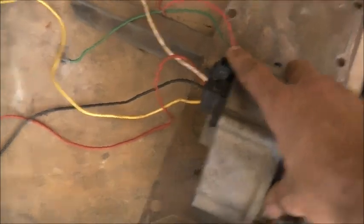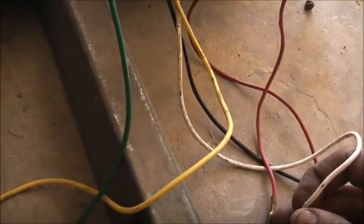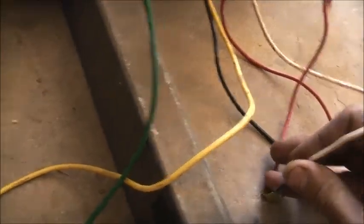Excite the inner field — it obviously generates AC. I've taken the diode pack out and the regulator out. The right tap gives me 72 volts between there and there; this one gives 42 volts between there and there. Another two are the excited ones. I'm going to see if this will actually self-excite this time, because it does generate between 0.3 and 0.6 volts depending on the RPM when there's no excitation. There was a little bit of residual magnetism in that inner rotor there, so we'll connect this up and see if it self-excites.